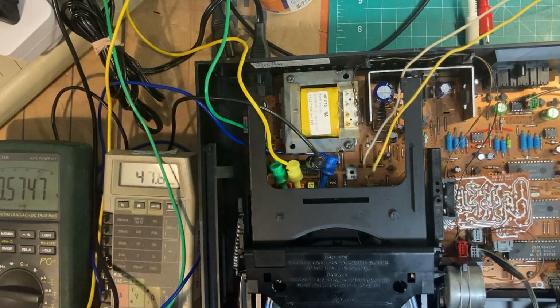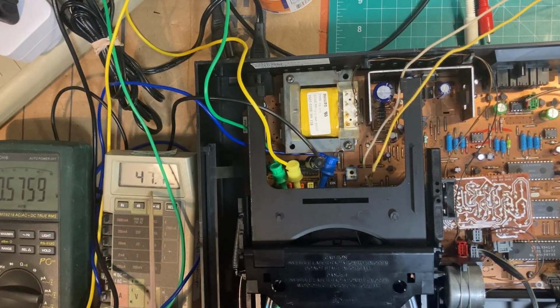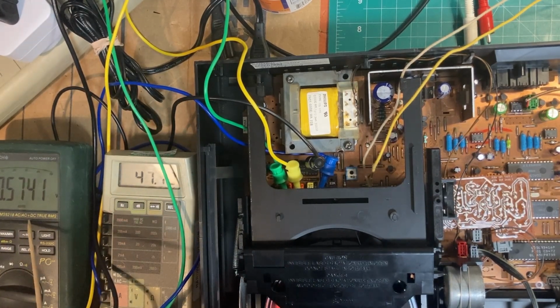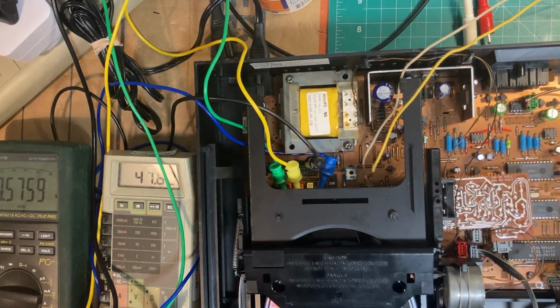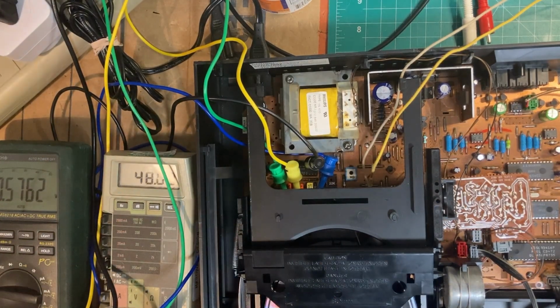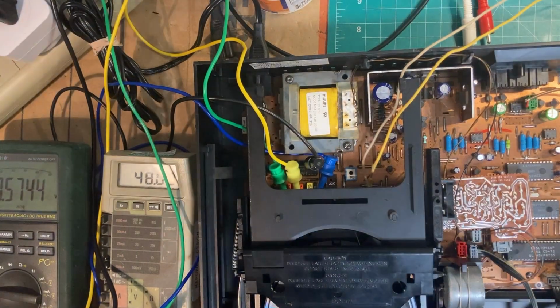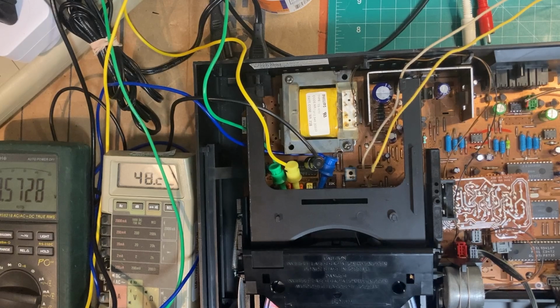Let me just disconnect that. And you can see we're within plus or minus 5, that's 47. That one's a little high, but I found that it varies quite considerably from track to track and from disc to disc. So I picked a disc that I'm pretty happy with. I set it for spec 400, and then it seems to work flawlessly throughout, so I'm going with that.